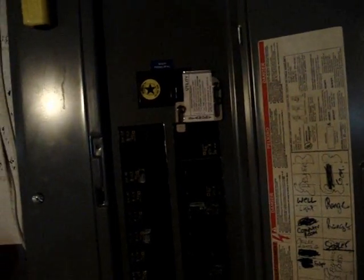As you can see here, it's my circuit box. This switch here is what you install along with a 30 amp double breaker. What this switch does is — you have to kill the main when you want to use this setup. So what you do is kill your main after your power goes out, hook up your generator, turn your generator on, and plug the generator into a box that's in the garage, which I'm going to show you. Then you'll flip on your main and flip on the backup. These ones with white on them are the circuits I'm going to turn on to run what I need.